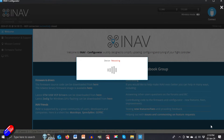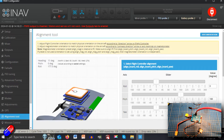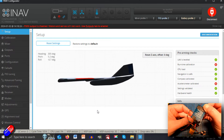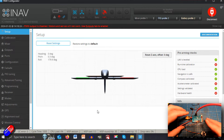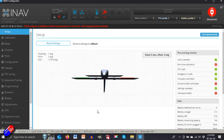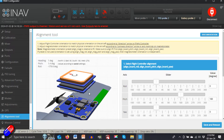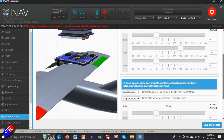Now because the flight controller is physically right-side up on the table but iNav thinks it's upside down, the model in the setup tab is going to appear upside down. But that is the way it's going to fly. Double check that this bit is absolutely right first — that looks pretty reasonable. That is going to work for Mystic Guido 1. Next thing to do then is go into the alignment tool and do the compass piece.